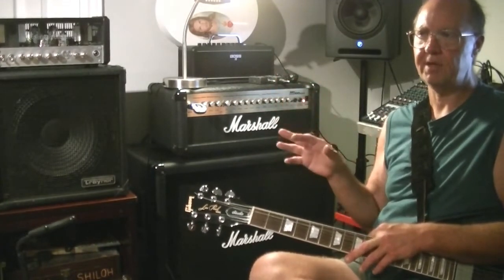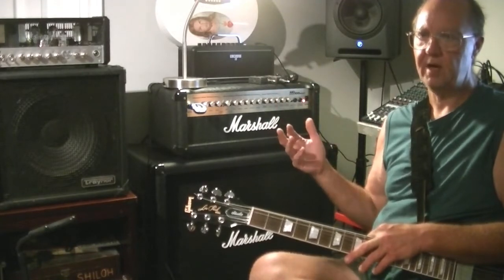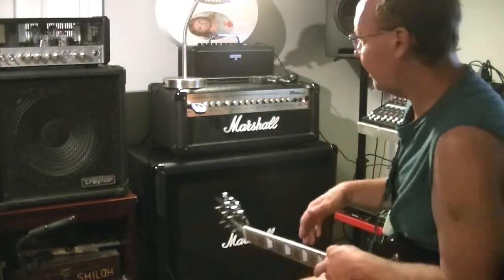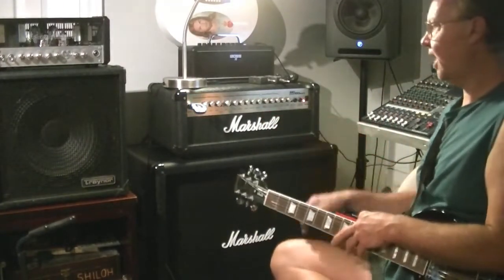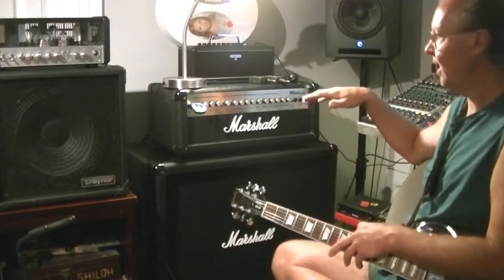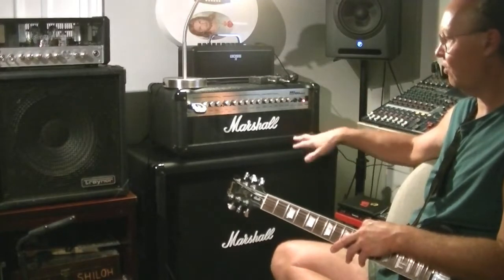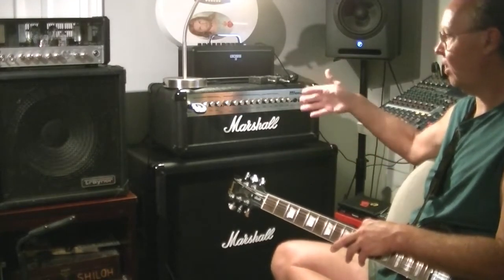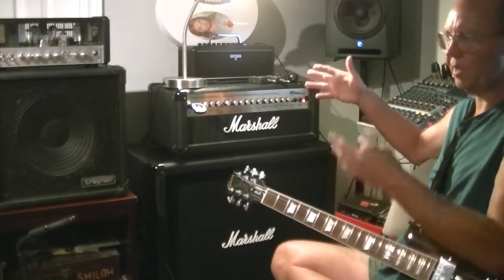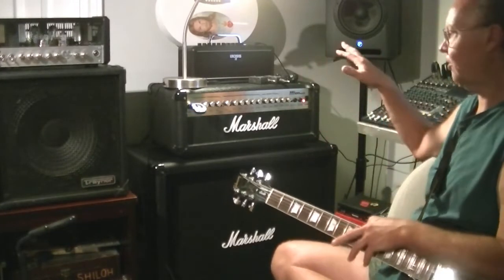They actually recommend to go with the higher impedance speaker that has the most volume output for that. So like we're getting 100 watts here, 4x12, 16 ohm cab. We're good with that. If I drop down to an 8 ohm setup, I can go 4x12 8, or I can go dual stereo. Basically drop them. There's a lot of combinations, I'll put it to you that way.